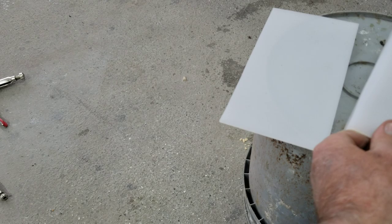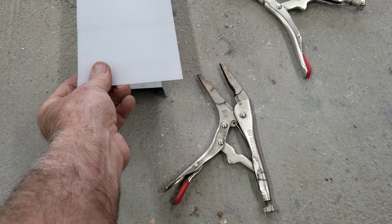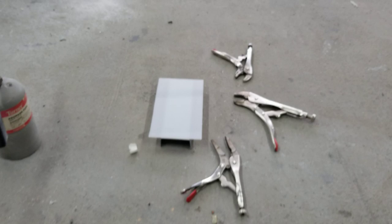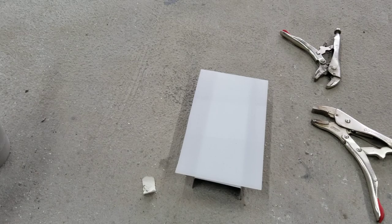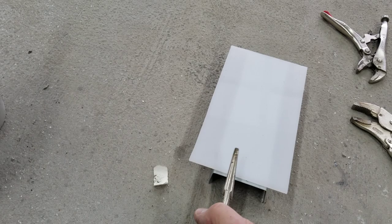It's a little dirty — I'll clean it up, it'll be fine. It's a lot of form, it's not perfect, but when it's in the car it looks great. Here's how I do it — I made a pan form. I believe this product is Lexan. It's one of the plexes — I think it's Lexan. 50% is what I got, so it's got 50% light transmission.